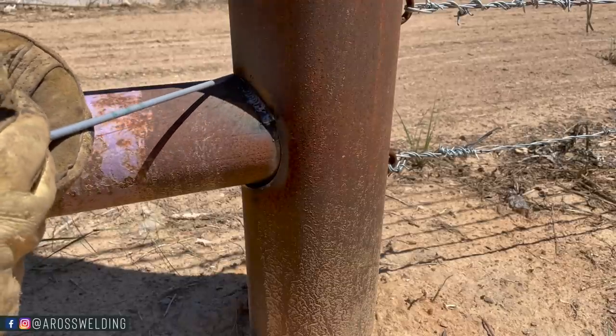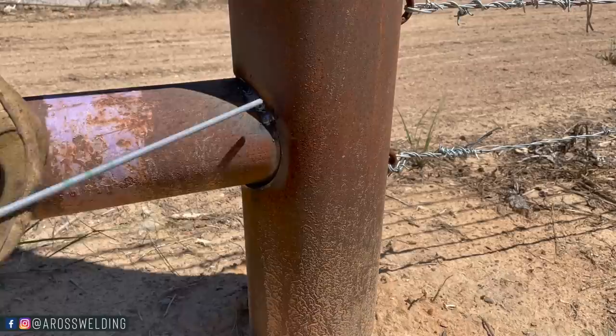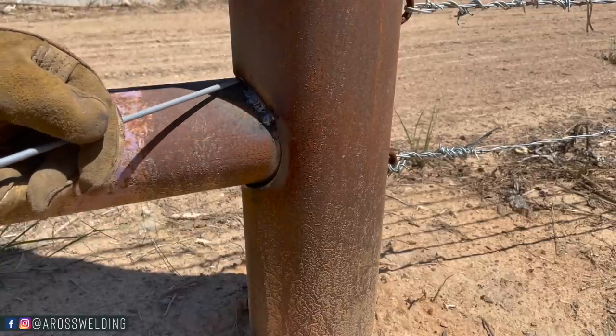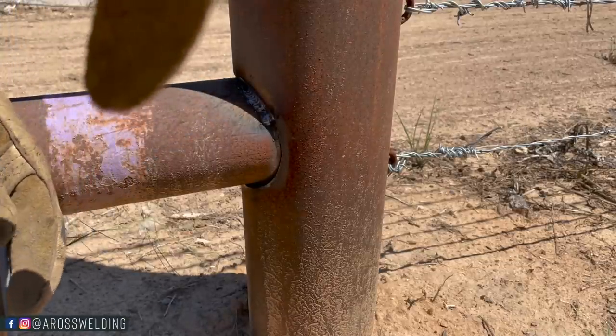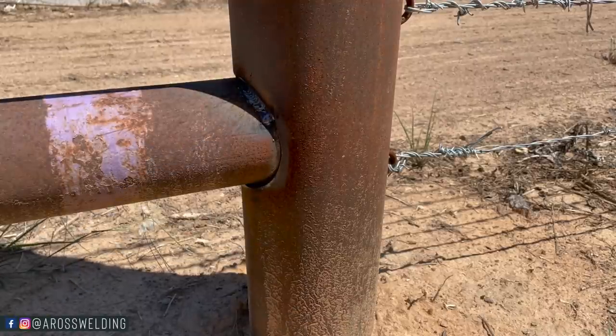Based off my experience it would probably weld better clockwise - in other words downhill - all the way around this piece of pipe, just based off the way it was treating me going this way. But anyway, I'm just really trying to connect with you as much as possible about what I do to weld magnetized pipe. Let's fire up again and see what happens.